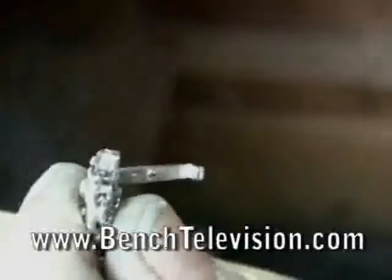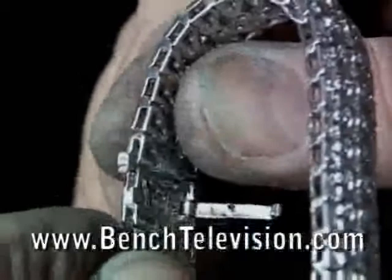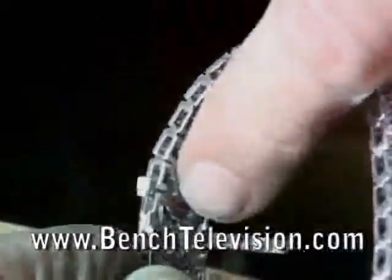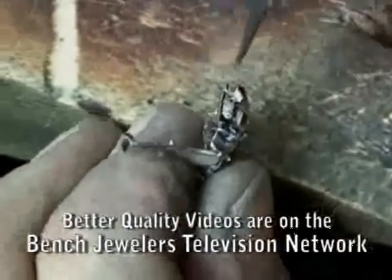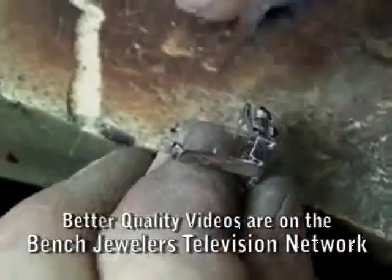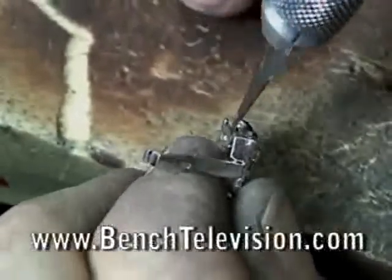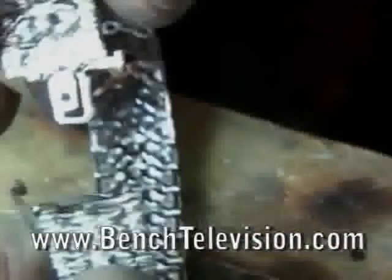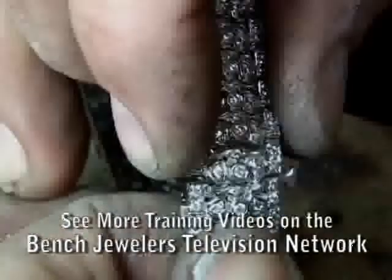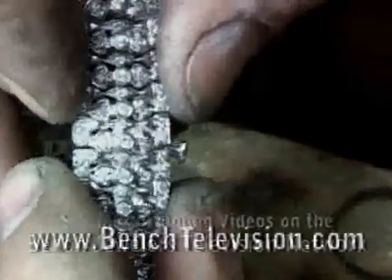Where this tongue connects inside the bracelet right there is worn out as well. So I'm going to go inside here and sharpen that. Because gold is very soft, I'm just going to take my razor blade and knock that worn edge off — just shave a little bit of that metal away. Now let's listen for the snap. Now that bracelet clasp is as tight as it was the day it was made.